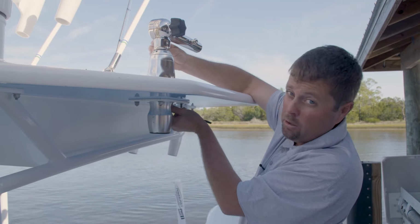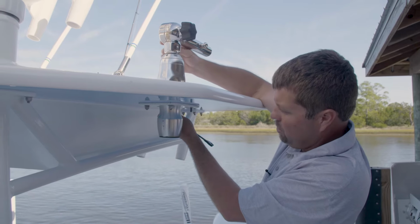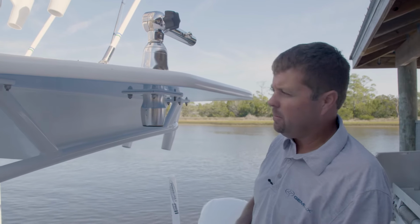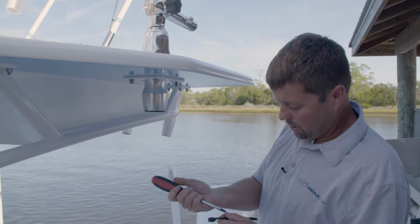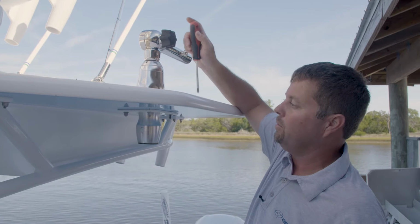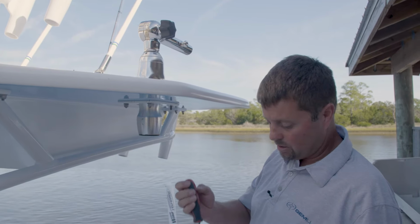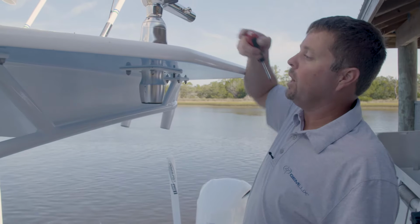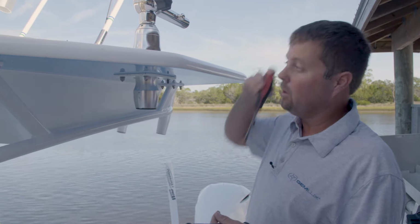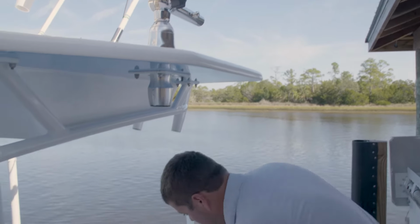As you'll see, you're probably wondering why I'm using a hand tool as opposed to using an impact of sorts. It would be a lot faster that way, but one of the major problems with using power tools is that you can run it too fast and you can strip the head of the screw, which is a major problem down the road if you're trying to take it out later. Second of all, it's going to help accelerate the rusting process on the stainless steel bolts, and then that'll be another problem. You'll have what we call the ring of fire. So just doing it by hand tools, you can do it nice and easy. Be able to put the screwdriver in, hold a nice little spot, and not try to turn it too hard and booger up the tops of your through bolts.